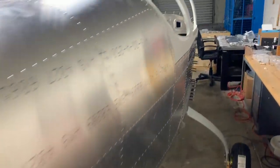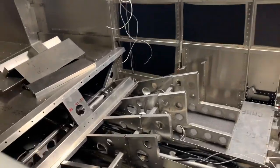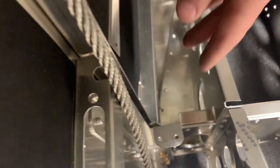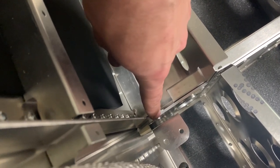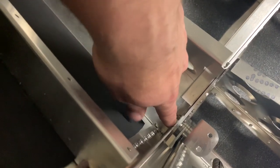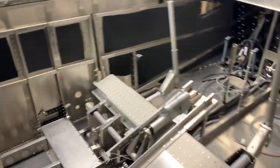All in all, it's been a fun week — a lot of preparation over the last couple weeks, and then finally getting things done this week. I've got the parachute cables bolted up here. Just a heads up to anybody building: the cable can't slide into its groove because of the top rivet head on both sides. I was able to get that one in by drilling out the top rivet, sliding the cable in, and I'll rivet it back up later. The AN6 bolts weren't included in my kit — or at least I can't find them — so I'm going to have to order some.